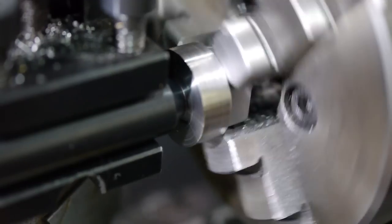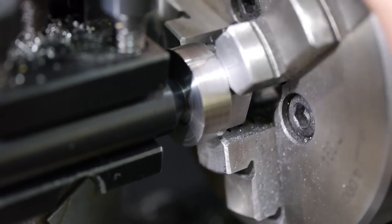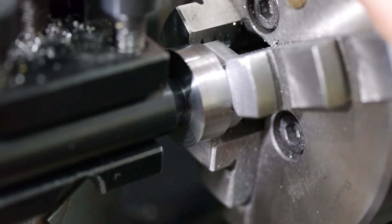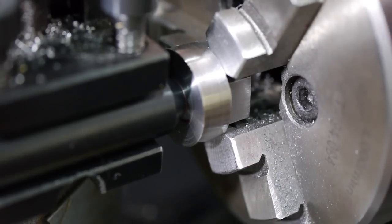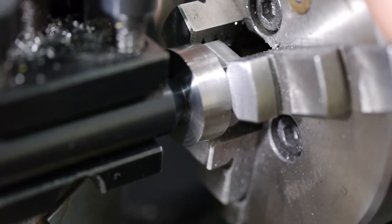With the third pass, I crashed the tool into the part. It wasn't a particularly hard crash, but it wedged the taper of the tool into the hole, and with the lead screw engaged, the whole lathe was now locked up. To free everything up, I ended up needing to disengage the screw and disassemble the tool post. This was clearly a risky threading operation, and rather than try again, I decided to use a tap.